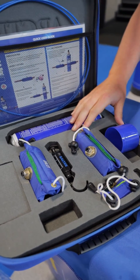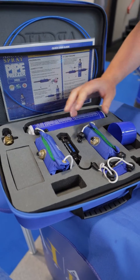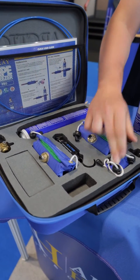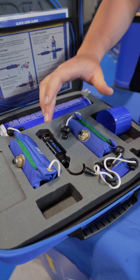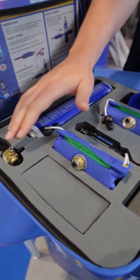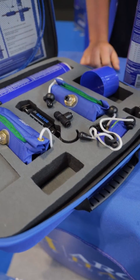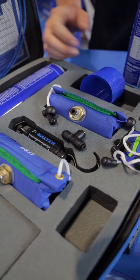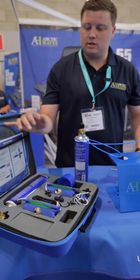The good thing with this kit is that it's the step up with the carry case. It comes with two different size jackets: 8-15mm jackets and 15-22mm jackets. You've got your weighing scales for your gas, and the key selling point with this case is that you've got your regulator valve. Also with this kit comes your T-piece connector, which means you can carry out a dual freeze using two jackets at the same time. You've also got your instructions and your nylon tubes.